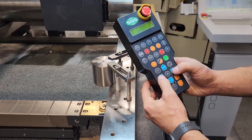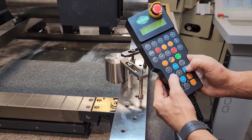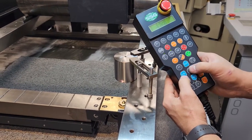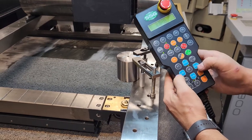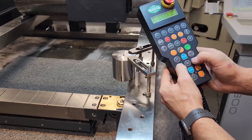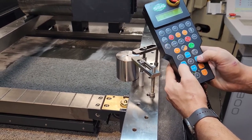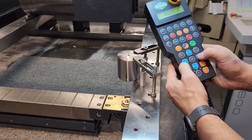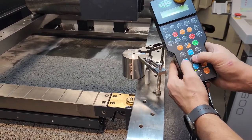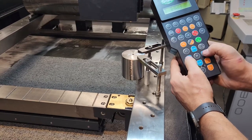Right there. Now I'm going to back it off, turn my UV on, and walk my U-axis over. Turn it off, pull the part away, turn it back on, walk my X-axis over. Still too heavy on the bottom — walk X away, U on, bring U in. Getting closer, back it off just a little, walk U over. Just kind of tap it until you get a light spark like that. We're still a little bit heavy on the bottom, so we bump U one more time. Now when you come in, we're pretty straight up and down right there.